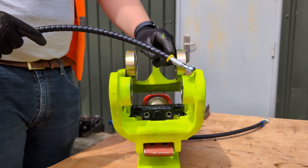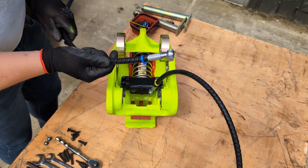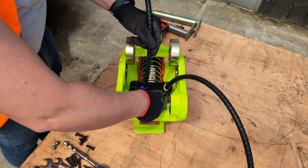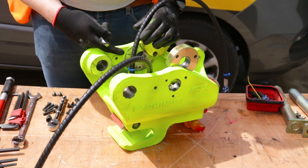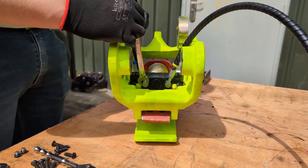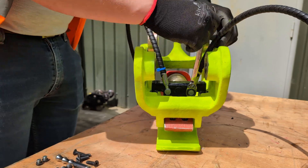so that's this side — this port would take the yellow fitting which then pipes into the machine circuit. And same for the other port as well; this is a blue marked hose. What we'll do is just splay the hoses slightly to the side so it clears the machine when you come through. We'll tighten these with a 14mm spanner. You could also use a ratchet spanner to make life a little bit easier.